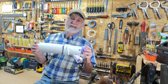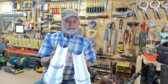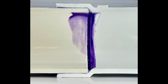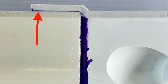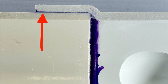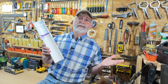It has been just about exactly 48 hours since I glued up this joint. I managed to get a pretty respectable half-cut on this section, and I sanded and filed it so we could get a clear view of the glue lines. Here you can see a close-up of the glue line on one half, and here on the other half. Upon close examination, it appears tight most of the way, but where you see the arrow, it does have a slightly wider gap. Overall the glue line looks really good — the pipe is square-cut, all the way in, a full inch and a half, looking as good as it possibly could, except for that slightly thicker glue line I showed you.